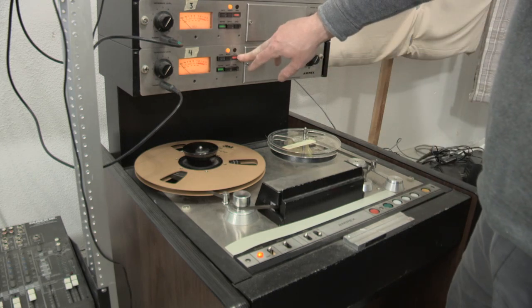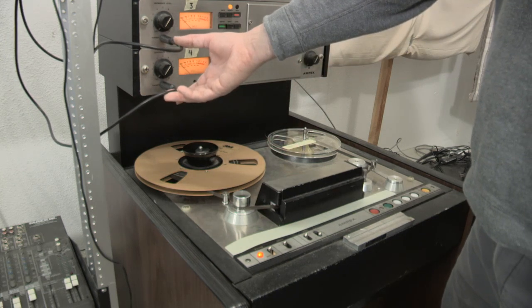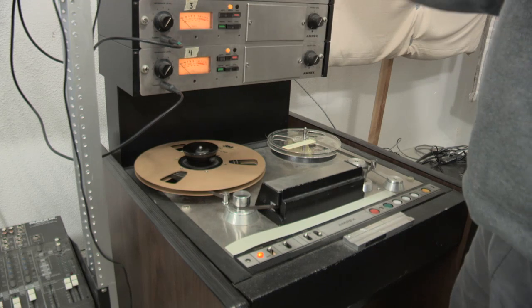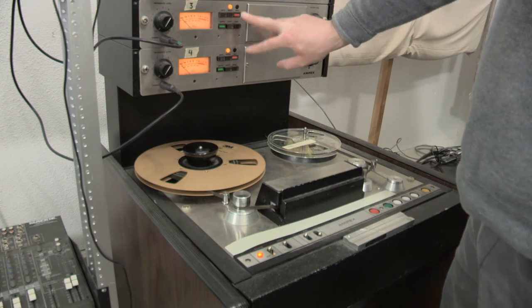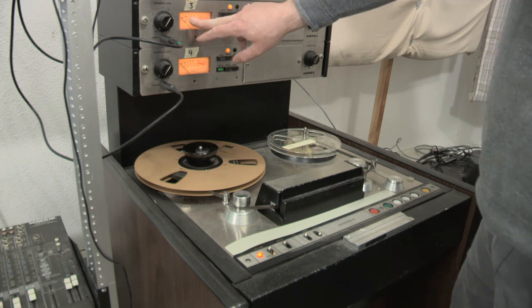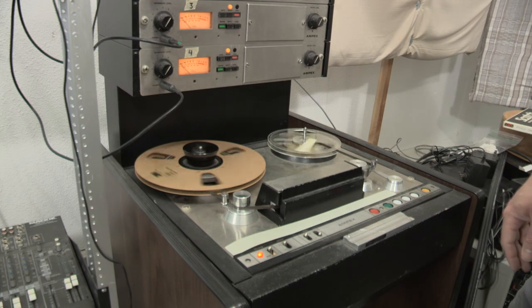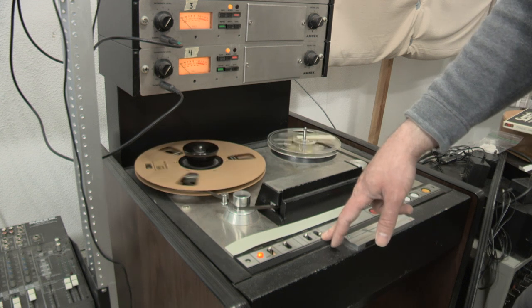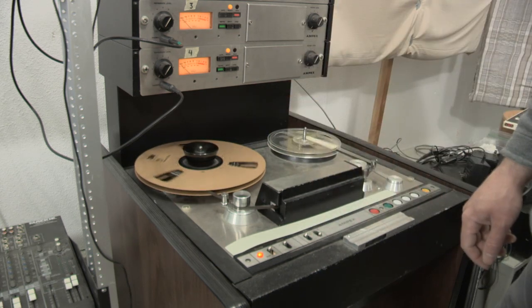I have the bias engaged here, so you will not see these VU meters move. Two reasons: I'm using the phone jacks on the front — driven by the same amplifier as the main outputs — to send to my recorder, because these bypass the output transformer, which is not really necessary for modern equipment. And I switch this to bias so that the VU meters don't load the signal, as they can create odd non-linearities under certain conditions. I get the purest sound by switching into bias mode. I'm also making sure that the reel size on the take-up is set to small and the supply side is set to large, to keep tension as even as possible.